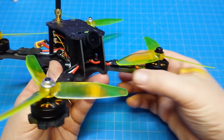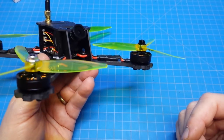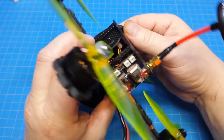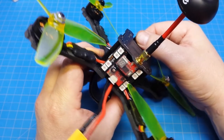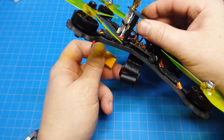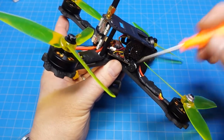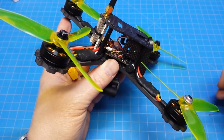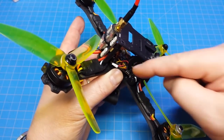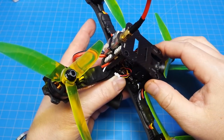The camera does appear to be a CCD camera, but we'll take the top off and take a closer look. We have a battery lead here that's the appropriate length — we can get that down over here on the side of our battery and plug in. It's nice that they already included a lead for receivers that hook up to these ports. I typically use DSM, so that's usually 3.3 volts. Most receivers can run off of 5 volts or even greater ranges. Let's take the props, the antenna, and the top off and take a closer look at the brains of this machine.